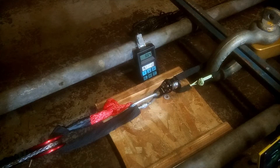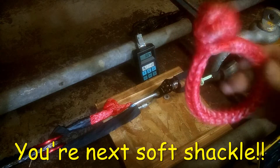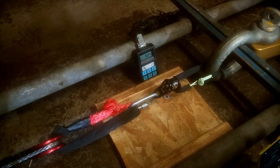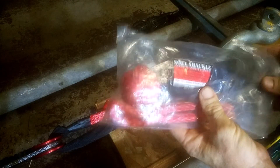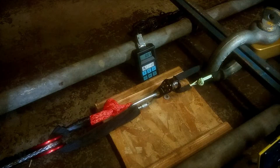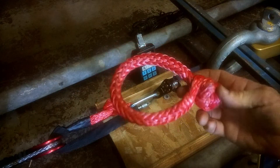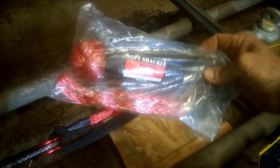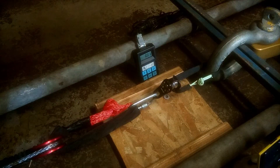Hope some of you get something out of that. Coming up soon on this machine, we'll get this one snapped — this soft shackle made of 10mm Dyneema, old school version that I've made myself. And also going to do one of these Chinese-made soft shackles that somebody requested, also made of 10mm Dyneema, but they're a little bit different construction, so this should be a little bit stronger. I'm expecting somewhere around about 15 tonne out of that one, and 17–18 tonne out of this one. Chuck us a subscribe and you'll catch those videos when they pop up.